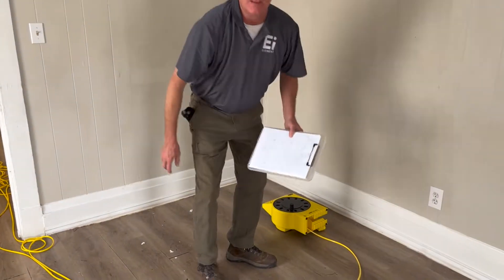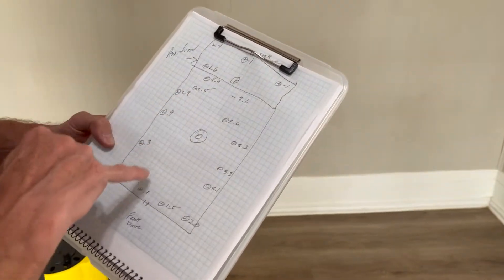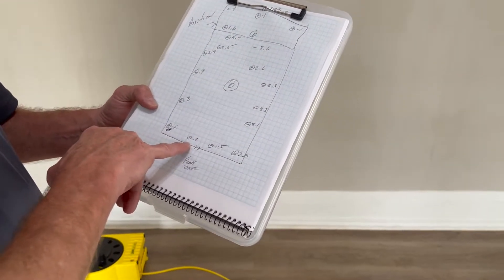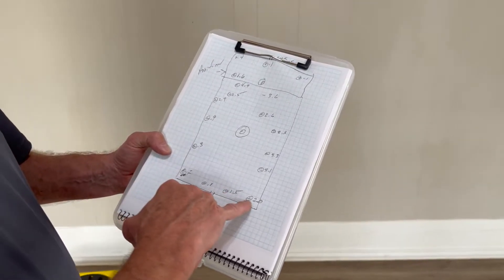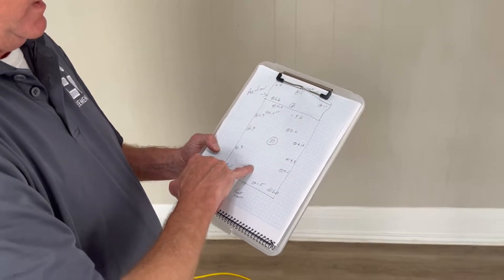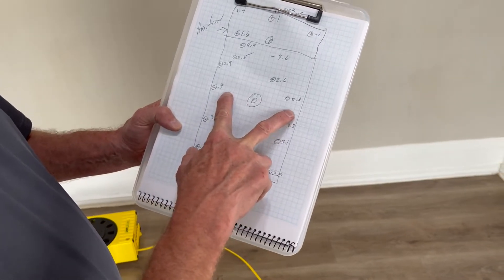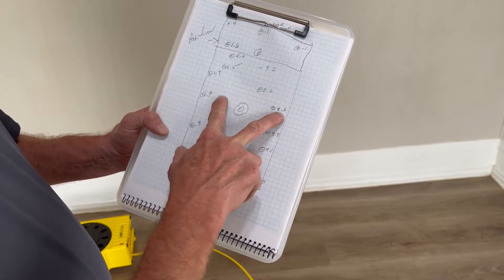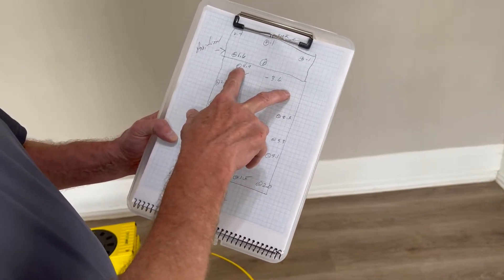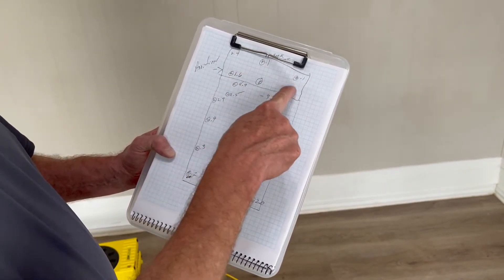Adam's finishing up. What's our biggest difference? Zero in the center. From the front of the house we're at negative 1.1 to 1.2, and then as we're moving back to the back of the house you can see an obvious progression downhill. That corner is 4.9 inches before the addition — and the addition was actually the levelest part of the entire house.